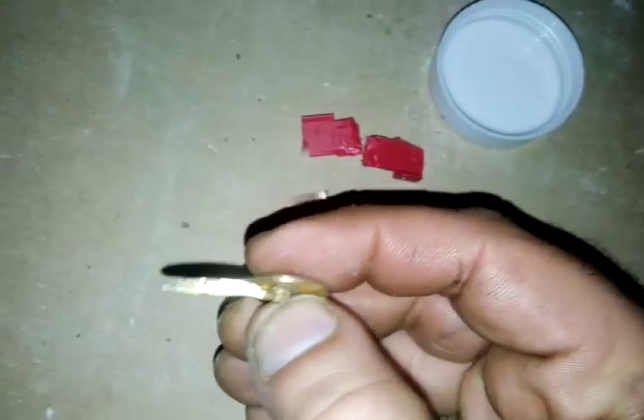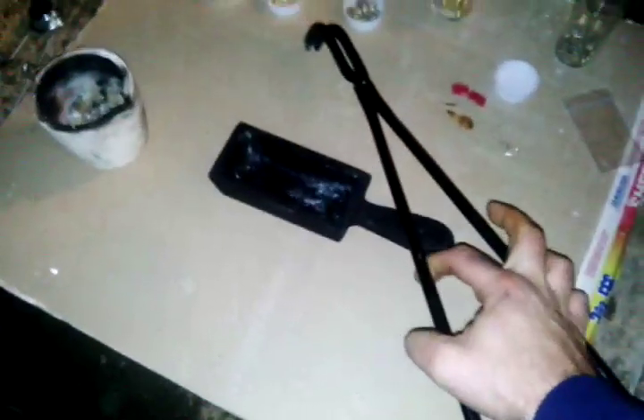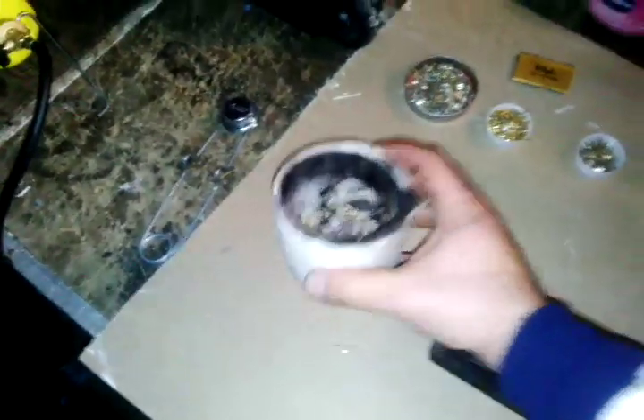This is a gold cufflink I found on the floor — I'm just attracting gold everywhere. Now let me show you what we're going to do. You're going to want some Vaseline and some borax; the borax helps with the melting process. This is a cast iron ingot mold — you put Vaseline inside so the metal doesn't stick. You'll also need tongs to grab the crucible and pour molten metal into the mold. The crucible is already filled with IDE pins and we're ready to go.